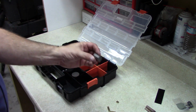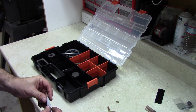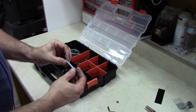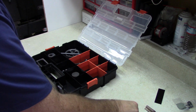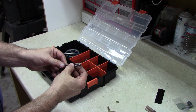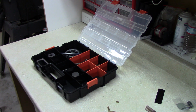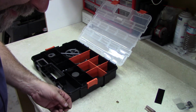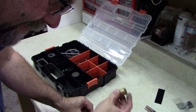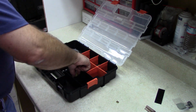And the eccentric sheave is a smaller piece of iron rod, or mild steel rod, rather. The crank webs are mild steel bar. The valve rod and the piston rod and a crosshead pin will be made out of these pieces of stainless steel that we'd found earlier. There are various bits and pieces of brass. The piston gland is 7/8 diameter, and that'll be used for the piston and the gland, so that'll be out of brass.